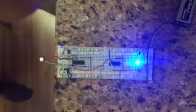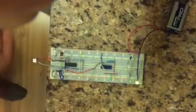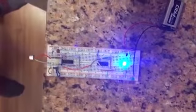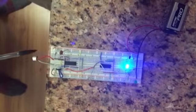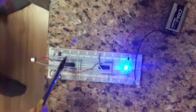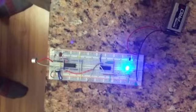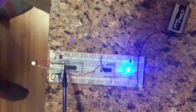The main purpose of our circuit is to have an LED that is off, and if you want to turn it on, we clap. And if you want to turn that LED off, we clap again. To detect the clap, we use a microphone, and the signal provided by our clap will be passed through a low pass filter. If the signal is lower than the cutoff frequency, then it will go to the comparator to see if any noticeable change has occurred.